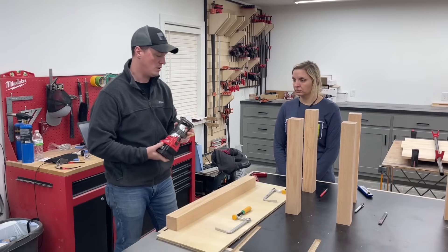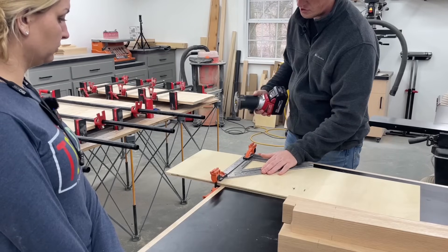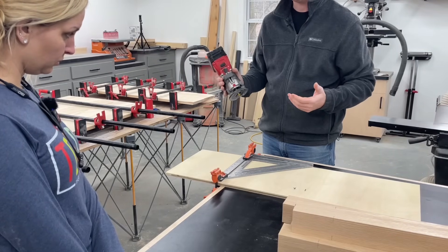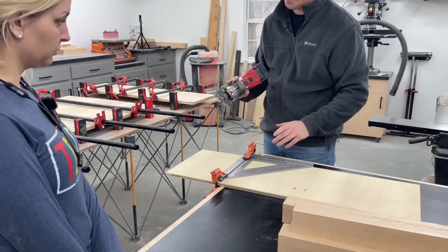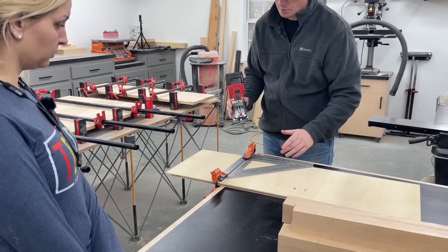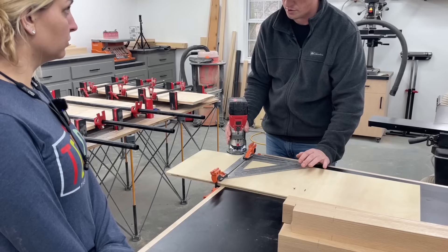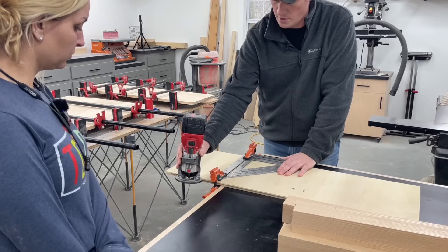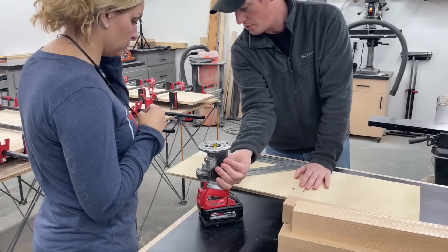So another new tool — we're going to make grooves that the clamps slide into to hold the piece to our jig. I clamped this square on here so you can ride the base of the router right along there. I feel like you haven't really been scared of any of these tools, but it's good to have a healthy respect for them. This is definitely one you always want to be aware of. It's got a good brake so it'll stop pretty quick. If you need to stop for whatever reason, you can't just pull it off — just stop and shut it off. Go with a steady pace, push it all the way through, don't set it down. Shut it off. You'll also want a dust mask for this.